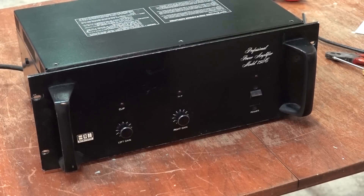What we're going to do in this video is put a lower voltage on a 12-volt computer fan with a separate power supply to operate that fan. We'll put it inside the cabinet and leave it running all the time. That way a smaller 12-volt fan shouldn't make that much noise, should be able to run constantly, and then he doesn't have to worry about the amplifier overheating.